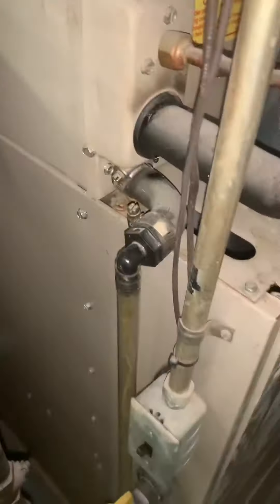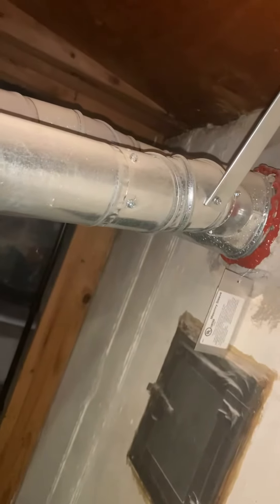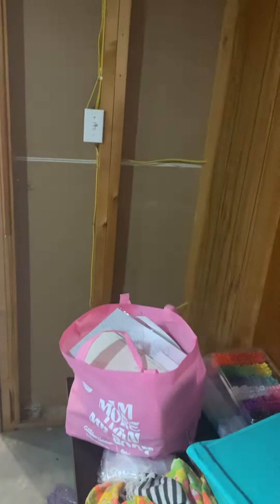Modify the gas line, the electric, and the flue piping — replace that coming up to the T. To meet code requirements, we are going to need a vent high and low right in this wall, so 8 by 14 on either one of those. I've got a newer water heater, so that's good. And then the drain just goes over to a floor drain right over here.